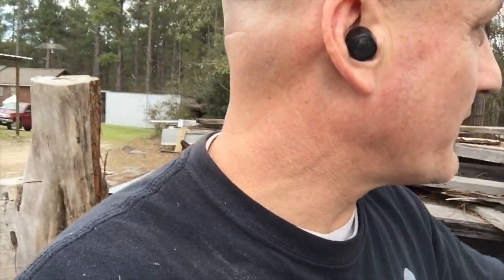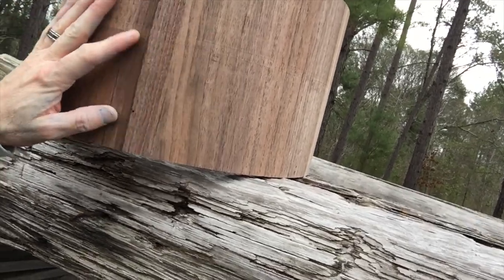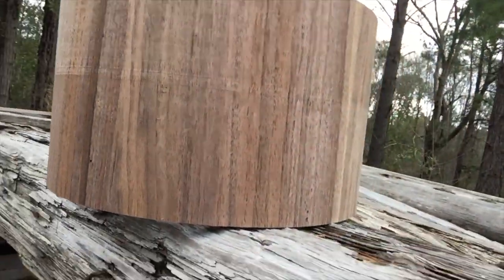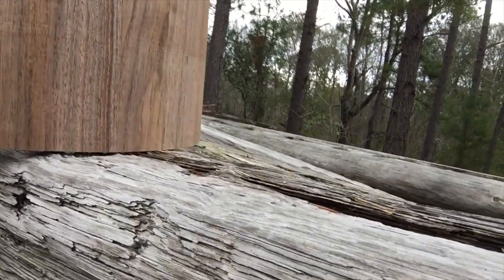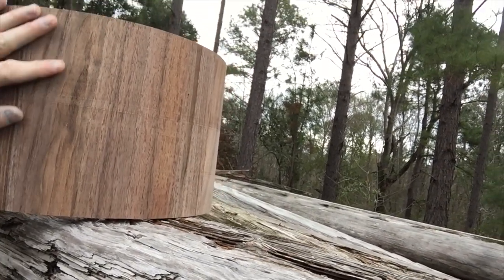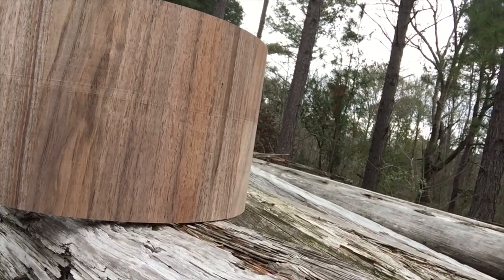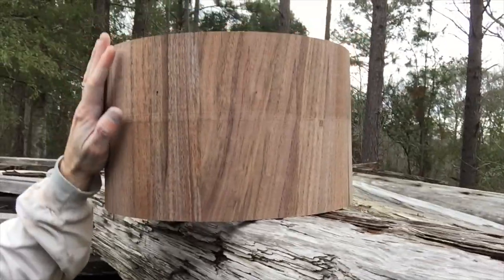I think it'll be easy to see why one of my favorite things to do is to mill the outside. As you can see, it really just uncovers all the colors, the patterns, the grain, and it gives you a really, really good look at just what the wood is like. And now I've done it enough where I know once we put the lacquer on this, we'll sand it down with an orbital 100 down to 220, and then we'll hand sand 220 to probably 400.